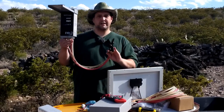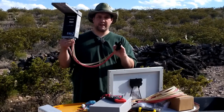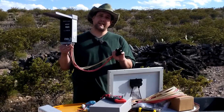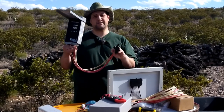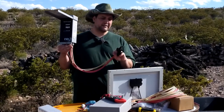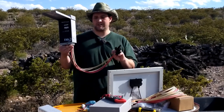You use this where your solar panels are. It turns off the individual strings of solar panels. It's really handy to be able to turn these things off and not have live wires to work on. It's actually required by the National Electric Code if this is ever going to get inspected. Plus, it's a very important safety feature — I highly recommend you use one.